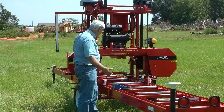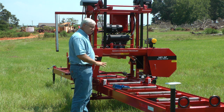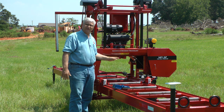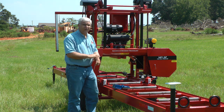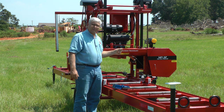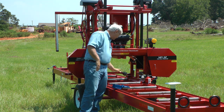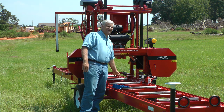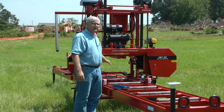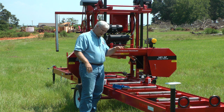You need an accurate way to tension so that you get the same result every time. Someone recently mentioned checking tension again after a cut — with our spring tension device that shouldn't be an issue. He mentioned the blade would heat up: if your blade is heating up in the cut, it's probably not tight enough and you're getting weaving and heat. A blade that is running and tensioned properly — when you shut the machine off after a cut and put your hand on the blade — it should be cool, sometimes even a little cooler from moisture in the wood. That blade does not run hot, no matter how fast you're sawing.